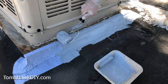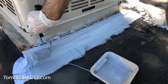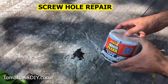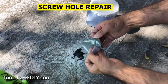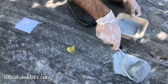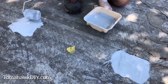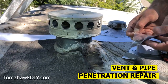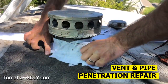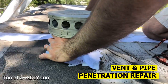We're just rolling it on, coating our waterproof tape. You want to put it over the edge or the seam — that's giving us that double layer protection. Let's look at how the rubber flex waterproof tape gets applied over a nail hole or a screw hole. We're going over those screw holes, coming out past the edges of our waterproof tape. I've cut alternating lines along the length of the tape, which should help us wrap this vent a little bit better. Now we're going to apply some pressure all around, trying to stick this into every crack and crevice on the surface we cleaned previously.